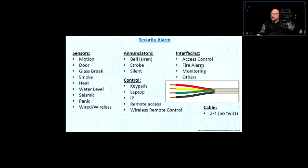Right? The security system can also be configured with a fire alarm. Remember that relay contact? It could be an output, programmed on a condition: if there's this alarm condition, close the relay. And that relay could be connected to one of the zones of the fire alarm, and the fire alarm can treat that as a condition. It will be a fire condition or something like that, right?